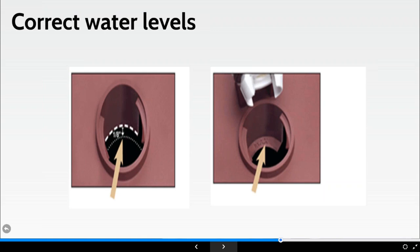Okay. Always avoid spilling or contacting battery acid on your skin or clothing. Those of you who've ever had it before will know that, well, it just looks like my clothing's damp, and I have had it before, I will add. It's only when you go to wash it that you find that it starts to fall apart. If you do get acid or electrolyte on your skin, then you need to neutralize any battery acid spills with, and the best thing is, baking soda and plenty of water.